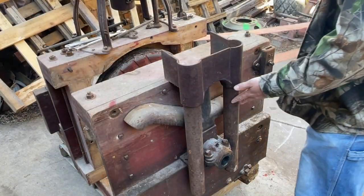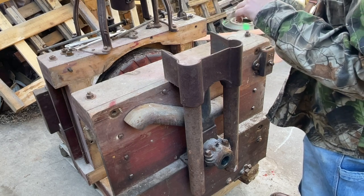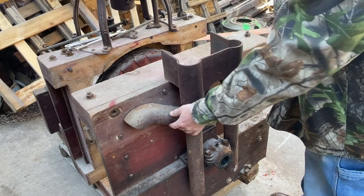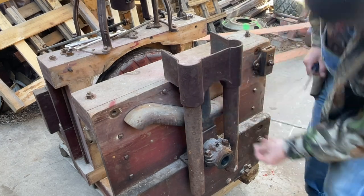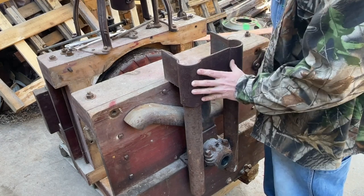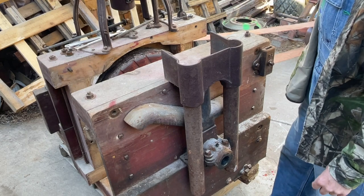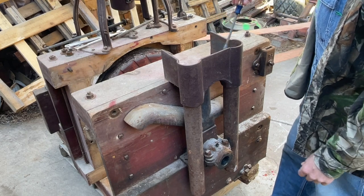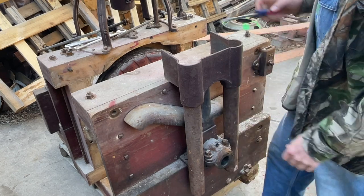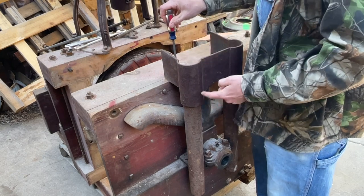This whole assembly, the drop where the grain falls down in the mill and where the air current blows across, is pretty much one piece. It's kind of put together, this section and this piece. This is where the trash off of the shoe that separates out on the shoe falls down and goes out these pipes and falls down there instead of blowing all over the place. New South is the only mill that had this design.